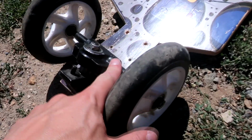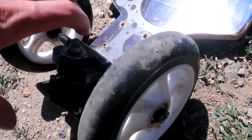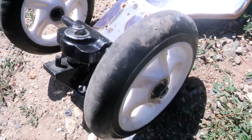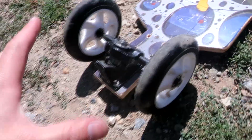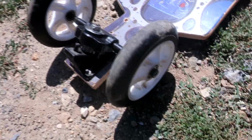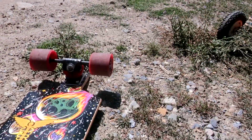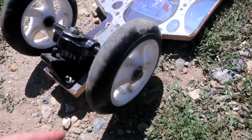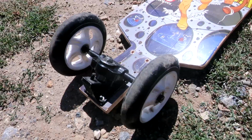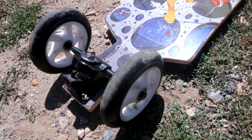flipping the Rojas. So the Roja has a decent amount of rake or offset, and right now it's configured so it's got negative rake. And basically, I took the resistance off so that the resistance isn't deadening the feel of what the geometry is doing. So I can really feel what's going on. I do have to have resistance on the rear, but I'm leaving the front loose. And I'm going to try back and forth what the positive rake feels like and what the negative rake feels like. And I'm going to try to determine if this negative rake is workable for this mountain board setup.